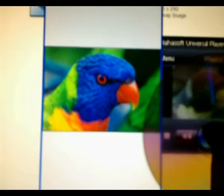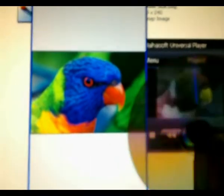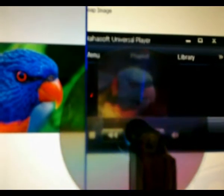Now, what I have here is the colour wheel in action. Beside, I've got the original picture of a lorikeet in its bright rosy colours. And here on the display, I've got an animation of the lorikeet with the red frame, green frame, and blue frame playing one after the other at a very rapid rate of 60 frames a second. Now I've got the colour wheel adjusted up so it's fast enough to take each frame, and with the persistence of human vision, a colour image is formed.